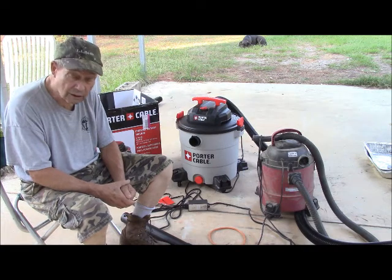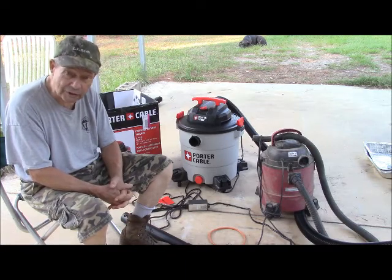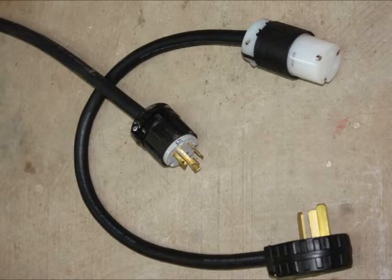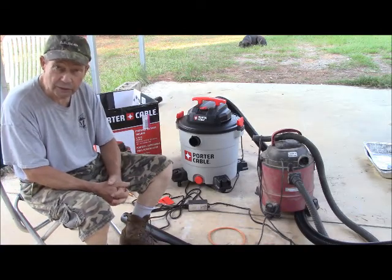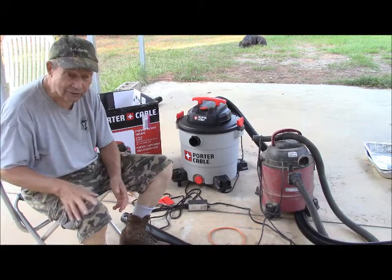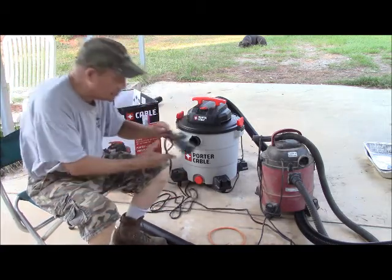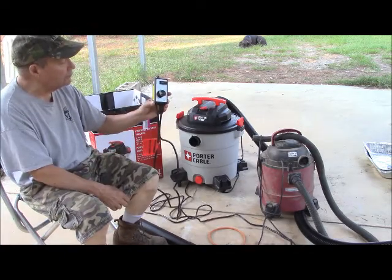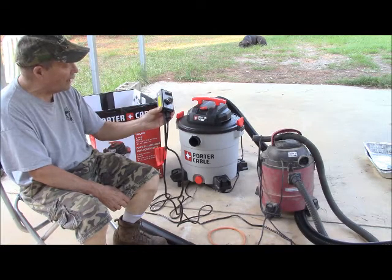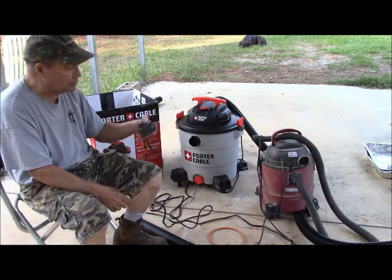You want a way to control it, and there is a way. Although when I originally raised this idea with an electrical repair shop, they said you could not change the speed of a single-speed engine, which is not true. In fact, hobbyists have been doing this for many decades with their electric train sets. Harbor Freight sells a variable control unit — in particular, it's item 43050, router speed control is what they call it. And it works very well.